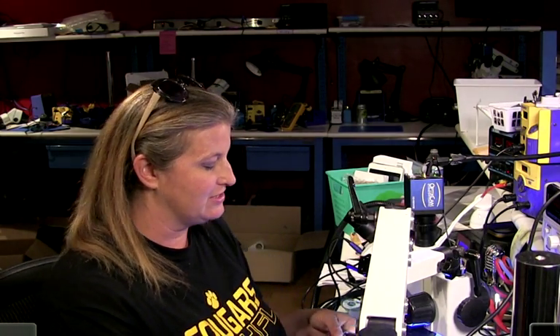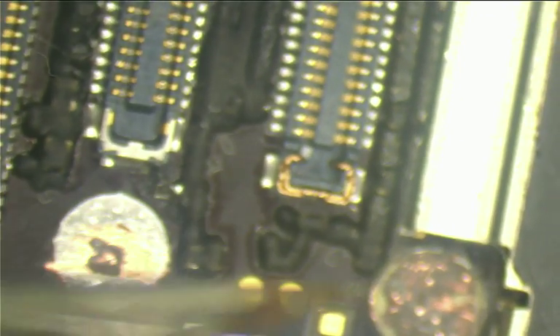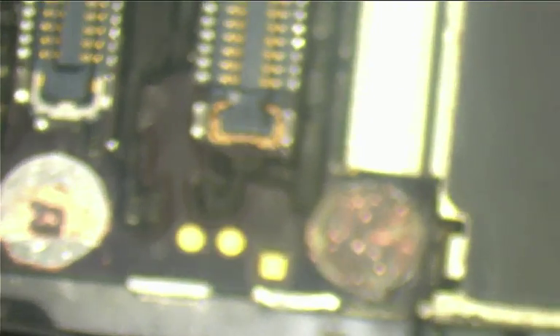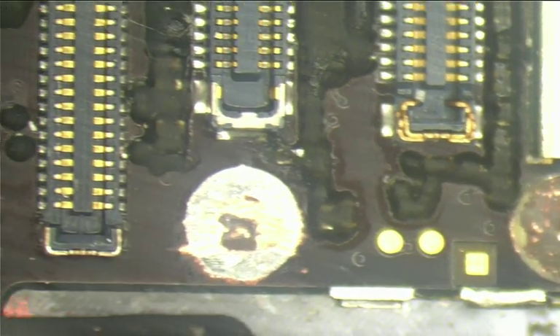There are complications to touch IC work, and here's one of them. The internet is telling people with touch IC disease: you see the gray flashing bars — why don't you tweak and twist and bend your phone? Why don't you try to screw foam on top and screw your screws down really hard? Well, don't do that. That's a bad idea. This phone came in for touch IC disease. I've already replaced the touch ICs and was putting it back together, and I found what we call a 'porn star phone' — it has been damaged in all three screw holes.